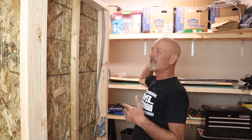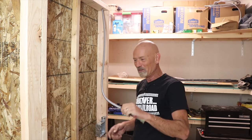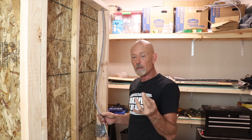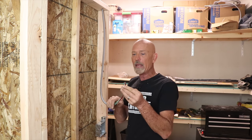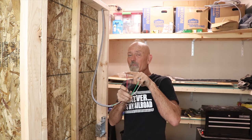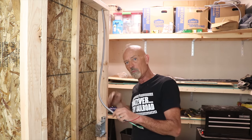We made the video about putting this lighting in up here above the hobby room, and when we did I introduced you to MC cable — that's Mike Charlie cable. It's an armored cable that's got wire in it already; it's convenient, a little pricey, but it works. The one we used up there had three wires: a green one for ground, a white one for neutral, and the power wire itself. Down here I intend to bring a circuit down and then run a switch leg back up to the receptacle to power it off the switch, so I bought 12/3 MC cable — it's got a green ground, a white neutral, a black power-carrying conductor, and a red wire that I'll use for the switch leg.